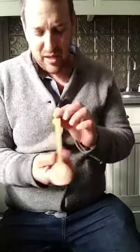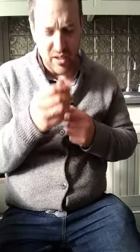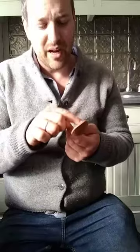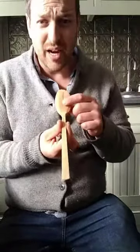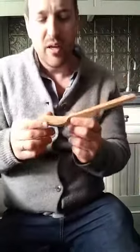So I get everything nice and cleaned up to this point, and you can see my process on those videos that I did last week. But basically, there's a point just before this where I take a pencil and I re-sketch in the shape exactly how I want it, and then I re-carve here, carve everything one more time, get to this point, and you'll notice that I haven't done the bowl at all. And I haven't even carved flat across the bowl. Instead, I've done these very shallow chamfers to reach the bowl.